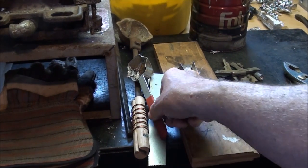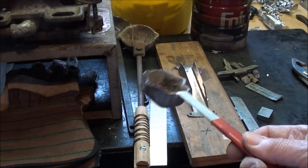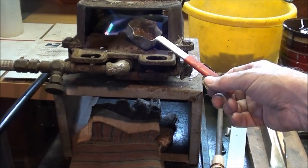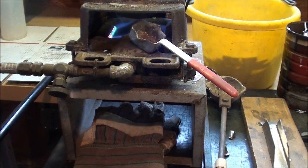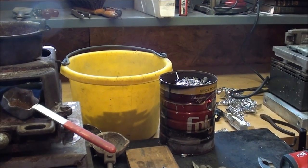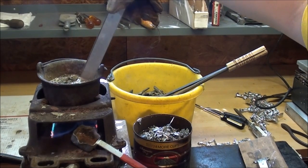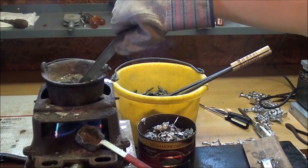On the table we've got a few other tools — some different ladles. We'll probably use the smaller one for the soldiers; it's easy to handle and the handle is insulated. These all need to be preheated too, so sometimes I put the ladles right in like that. This is my tool for scraping the dross. The yellow bucket is full of wheel weights primarily, and this Folgers can is my dross bucket. Jordan, you've got your glasses on — let's see how you do with scraping the dross. That's all waste material.